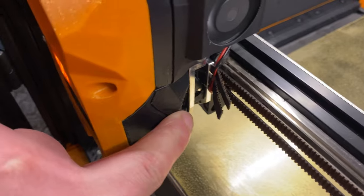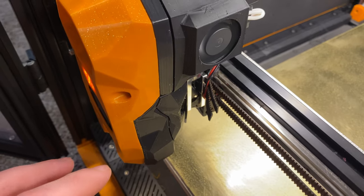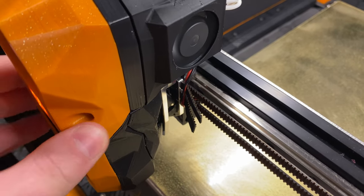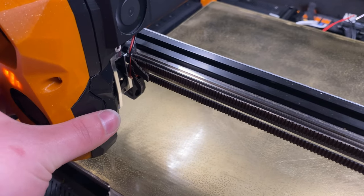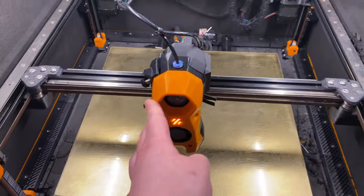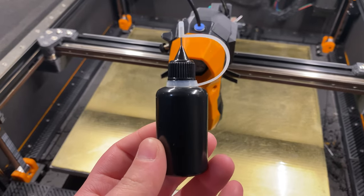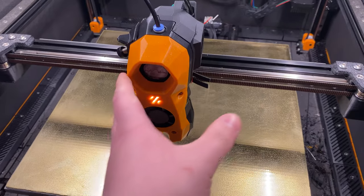The Vitaly TAP worked well until recently when I started getting bad top infill and probing issues. While recording I noticed a magnet had come loose — this is actually the second time I'm recording this because it came loose during the first recording too. That explains the issues. I'll talk more about the Vitaly TAP when I disassemble the gantry. The magnet holder designs aren't great — Voron's magnet holders are better designed than the Vitaly TAP's. I also experimented with Magigoo to deal with bad adhesion issues, which helped, but turns out the real problem was the TAP.